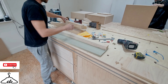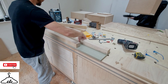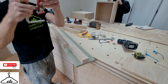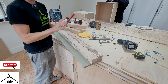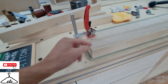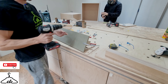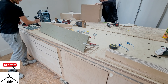I'm going to flip that back over because that's the best face and we've got a nice square fence. Next thing is to put your leg up against the edge, simply get your fence and push it up against your leg. Then we're going to clamp that down — I really like these ratchet clamps, they're so easy to use. We're going to go ahead and screw this fence on from the back, putting the screw straight in without any pre-drilling. So now we can take the clamps off.